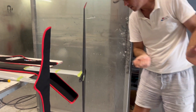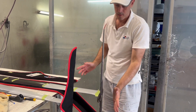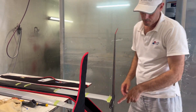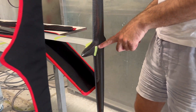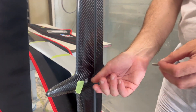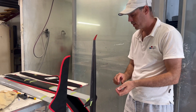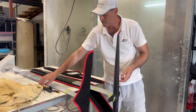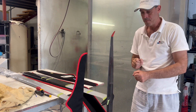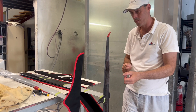Once you've got your foil and push rod in, take the whole lot, slide the push rod into the vertical, and rubber mallet bash it on. The bolt is a quarter-inch bolt — never put an M6 in there. I've supplied a spare as well. Always manually do up the thread until you can't anymore — that ensures it's not cross-fitted. It's really critical to manually start it, then get a screwdriver and finish it off. You want it pretty firm, nice and tight, but not excessive — just nice and firm tight.